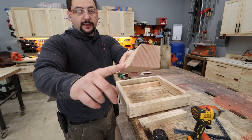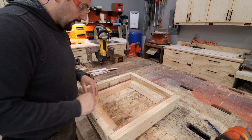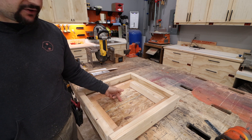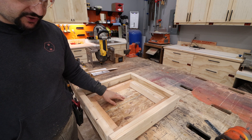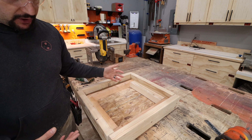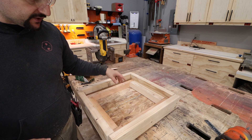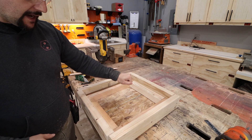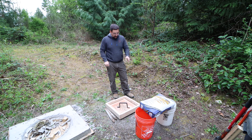So we beveled this edge, which gives us our taper profile for our lid. This gives us our casted lid, or what it's going to look like. This is a lot thicker than it needs to be for a diversion box lid for a drain field. However, this is what I'm working with and I got an 80-pound bag of concrete, so we're going to go ahead and use this setup and pour it the way it is. I'm going to go make a handle so that it's easier to remove once it is installed, and then mix this concrete up and get it poured in.